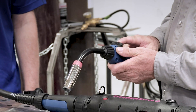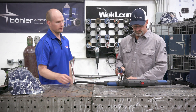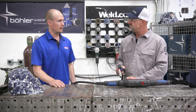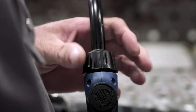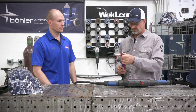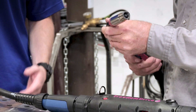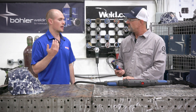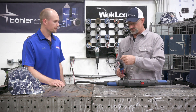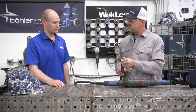There's also a potentiometer knob up top which works in conjunction with your range switch selector in the drive system, to help dial in your wire feed speed more effectively without going back to the wire feeder. And we have a lock nut that secures the torch neck in place - when loosened, you can rotate it a full 360 degrees. There's a locked key system in the mating portion so you can adjust it in any slot for any application - about six or seven positions, very convenient, simple to use. Very versatile.